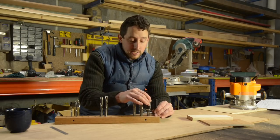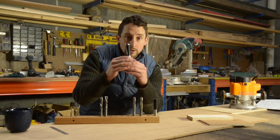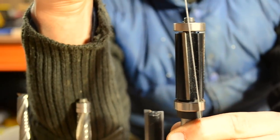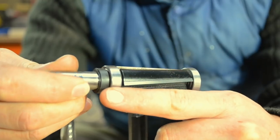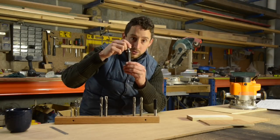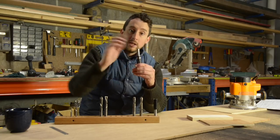In order to make those cuts smoother, router bit manufacturers have started putting these blades on a slight angle, which means instead of the blades hitting the timber all at once, they start to slice through from the top to the bottom. That allows for a smoother cut and lets the motor work a little bit less hard, because you're not just thumping through the wood in each pass.